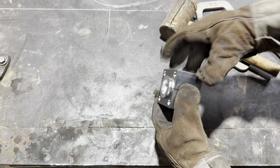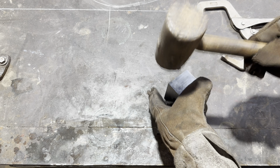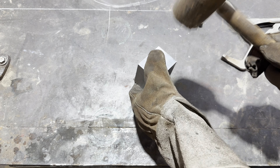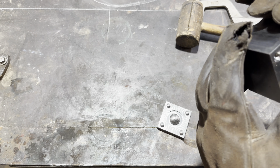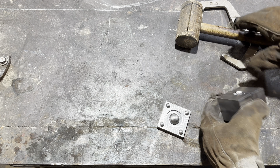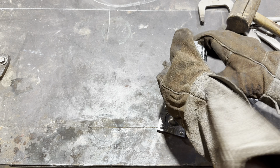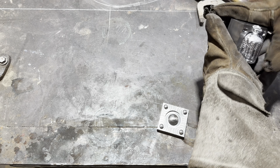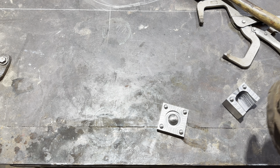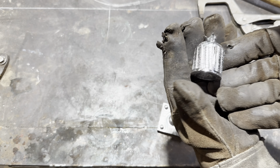This projectile design needed a little more persuasion than usual to get released from the mold. I got the bottom open pretty easily, but the sides wanted to stick together, so I started hitting them with our wooden mallet to get them to separate. The two sides did separate, but the projectile itself wouldn't fully release from the mold. I kept hitting it with the wooden mallet, and eventually one side broke free, but the projectile was still stuck. I tried yanking it out - that didn't work - so a couple of good whacks on the back of the mold finally released it. When the two halves weren't completely together while I was hitting it, it was messing up the rifling something fierce, so they didn't come out very pretty. I made a couple more slugs this way and they all turned out the same - just not very pretty. After a good night's sleep, I remembered that you guys suggested something that might help these release easier, so let's give that a shot.